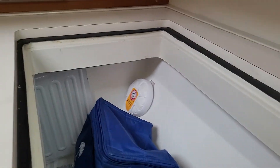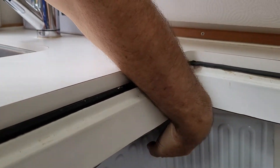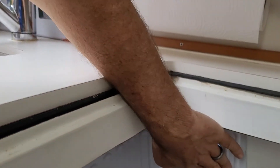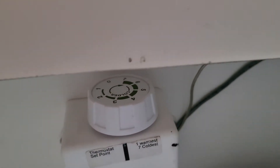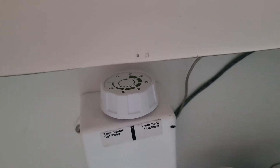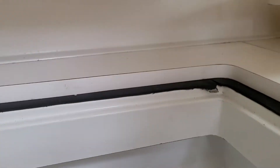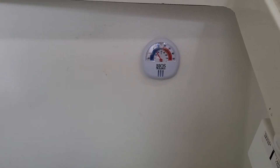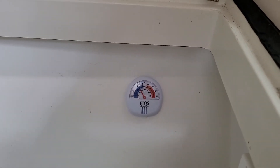Inside the icebox — let me open this now — you'll see there's the evaporator panel right over here. We were able to bend it and cut it in order to get it in, and the NovaCool kits come with all the hardware you need. Over on the other side, there is the thermostat. We set it at two and a half during the week, and if we're going to be on board for a few days, we put it up to three to compensate for the opening and closing of the icebox. The temperature gauge shows it keeps a nice zero degrees all week long, never uses much battery, and we're on our second year now with no issues.